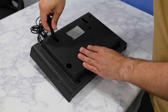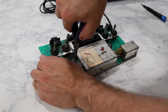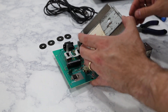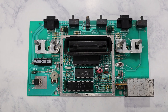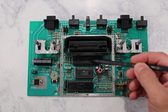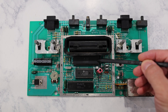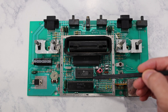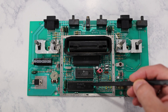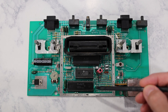To get started, we first need to open it up, which requires taking out a few screws from underneath. We do need to get under this EMI shielding, so we'll twist these tabs and remove that as well. You'll notice that we have three chips. This here is the Atari's 6507 processor. And this is the RIOT chip — there are no dedicated RAM chips on board, so this chip provides the RAM and manages part of the controller I/O in a single package. And this is the television interface adapter, better known as the TIA chip, which is responsible for producing both the audio and video signal. So it's the one we want to focus on for our composite mod.